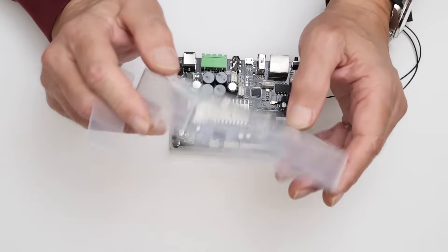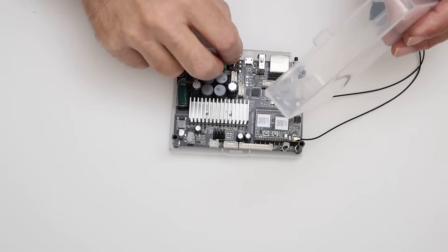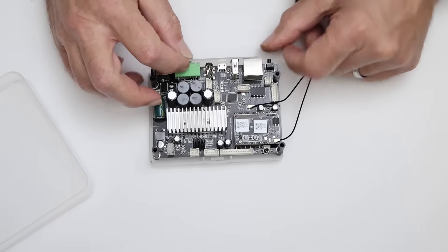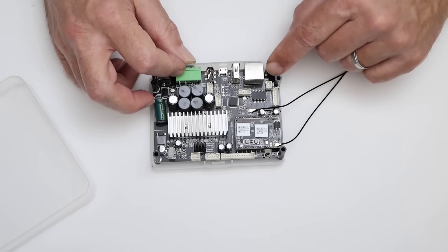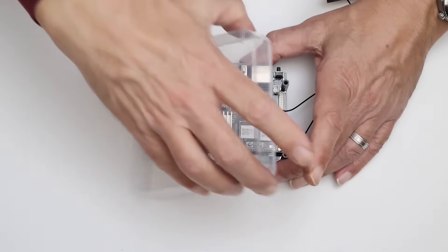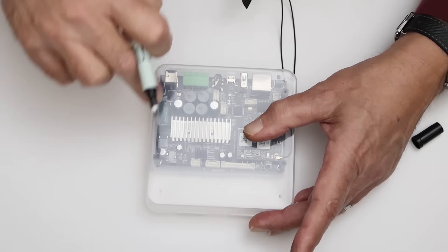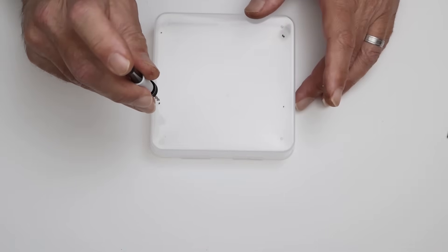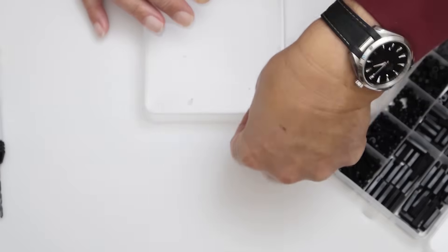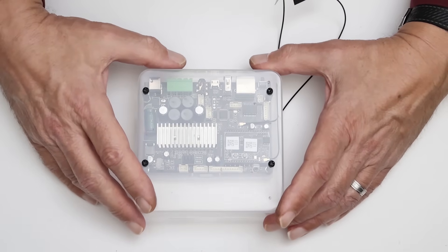We're going to use the base of the original box as the cover, and we need to mark out the screw holes. The important thing is to get a little spacer in front of the board — I'm using a piece of spare plastic cut from the original lid. The purpose of the spacer is so that the switch in the corner of the board is the right distance from the cover, because we're going to be cutting a button into the cover. Cover all the connectors except that switch with the scrap plastic, then place the cover over the top. The latch of the box goes by the spacer. Now mark the hole positions for the cover screws, which thread into the four black pillars. Make the small starter holes in the cover, then use the one-eighth drill to cut them to final size. Use the same size screws as in the base and push them through the cover holes — with a little luck the screws will line up perfectly with the pillars.